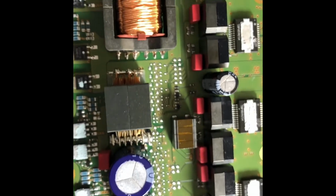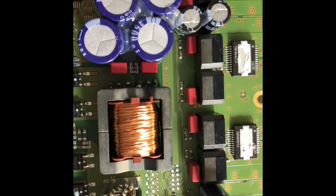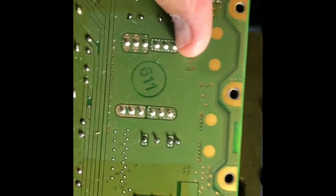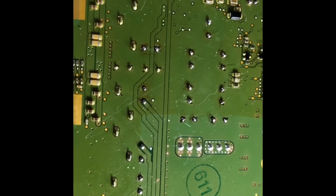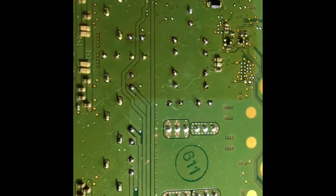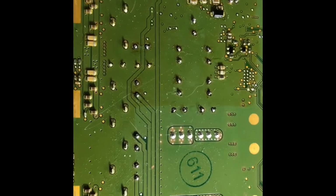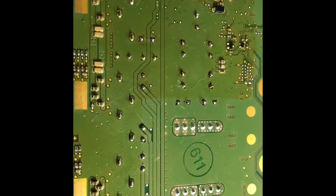So, well, the point is why this amplifier landed here, because after this cool upgrade, the amplifier doesn't work anymore. They have no idea what they're doing. That's number one thing. Number two, they think installing bigger capacitor is going to make a better quality. That's absolutely incorrect. You will not notice any difference at all here, completely. And Class AB, if you install film capacitors instead of ceramic, then yes, there might be maybe some better quality you're going to get, but only if you're audiophile, maybe you will notice it.